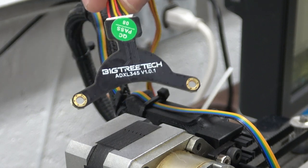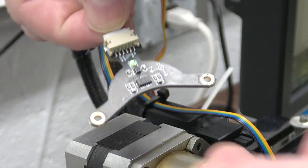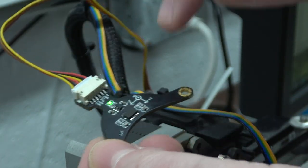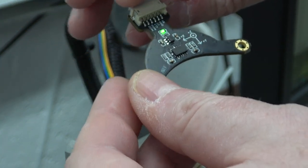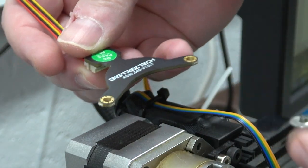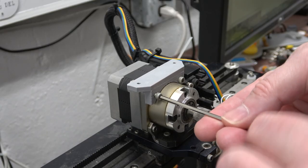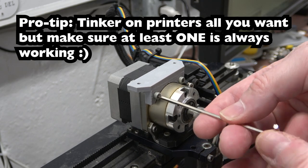Okay, input shaping. The Pad 7 came with this board. It's got an ADXL345 accelerometer on it. It shows the positions: X, Y, and Z, so Z plus. X positive on this printer is this way, Y positive is that way. So I need to mount this like that. And then I'll have to invert the Z, even though it doesn't sense Z. And I also have to do this twice because this is a bed slinger. I 3D printed a custom mount for the X axis. I'll probably just tape it to the bed for the Y axis.